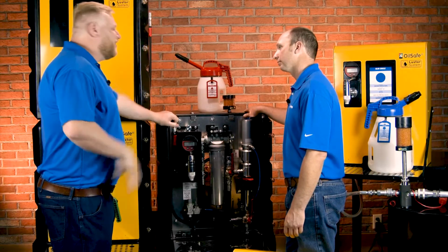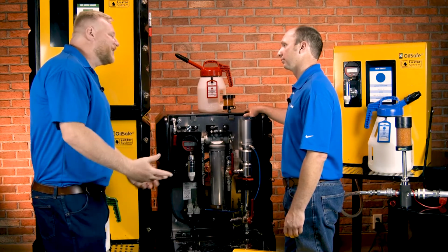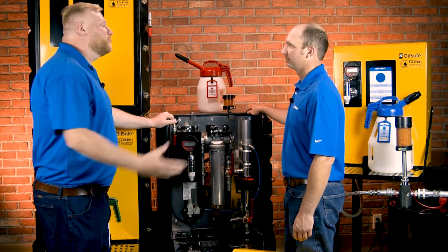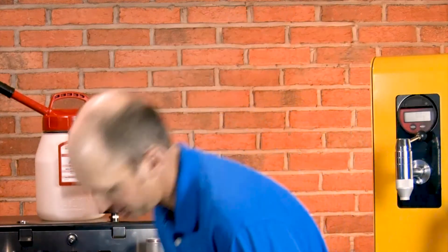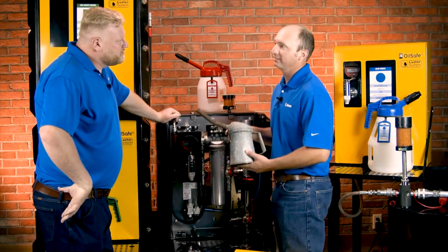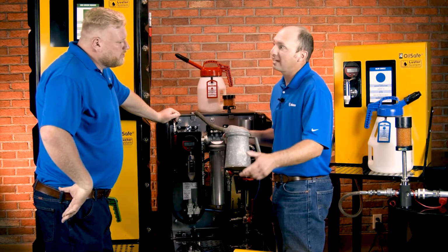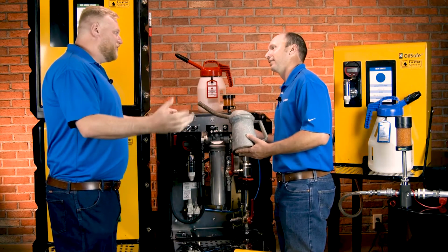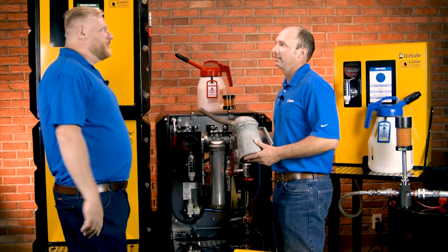So, you know, we've talked about the systems. We've got the three different types here. Let's talk about real world practices. You know, why do we use these guys versus pulling straight out of a drum or something like that? Yeah, so real world practice. You know, I travel the entire country, look at lubrication systems, and oftentimes I go in and see folks filtering or not filtering, maybe just pumping lubricant out of a barrel into something like this. Sure, they'll use a little hand pump and they'll use that same pump for 5 or 6 different drums, right? So we run into issues with cross-contamination with that.